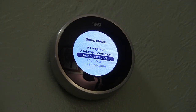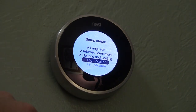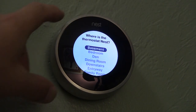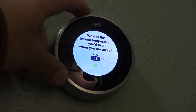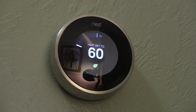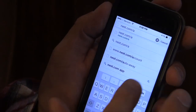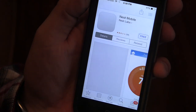The updating process can take a couple of minutes. Once done, go into the heating and cooling section to work on the settings — I have a gas-forced air heater so that's what I put in. Then enter your zip code, describe the location, and set where the Nest is in your home. After this, you can set the minimum temperature you'd like when you are away, which may differ if you have pets or depending on where you live. Click continue and the Nest will begin to learn your preferred temperature and schedule. To control the Nest from a smartphone, tablet, or computer, head over to nest.com/account to set up your account and download the Nest app.